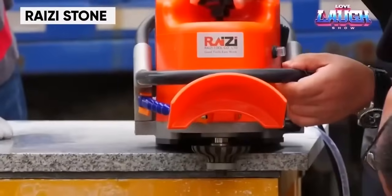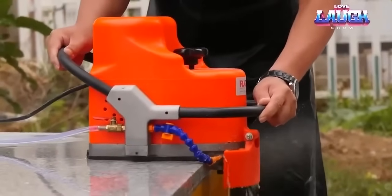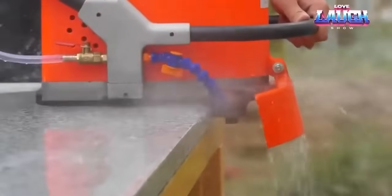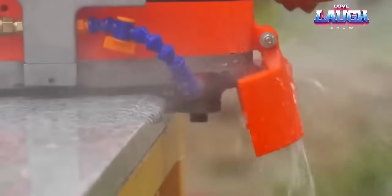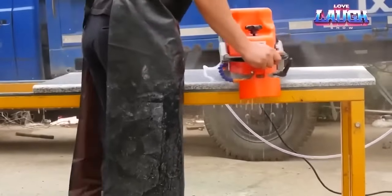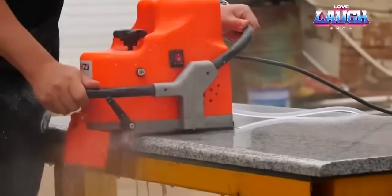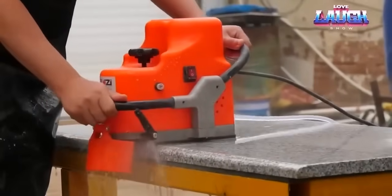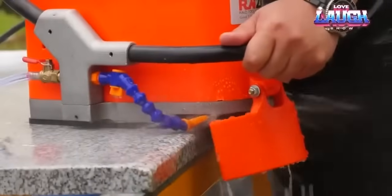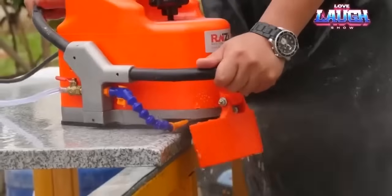The MJ3 is a bit more specific. It is a grinding and polishing machine for stone workpieces, including granite. It is lighter than many analogs, weighing only 26 pounds, but it is equipped with a 3-horsepower motor and allows you to adjust the speed up to 8,500 revolutions per minute, selecting the optimum depending on the task. Since water is used in the process, the MJ3 has received a splash guard, and protection against electric shock is guaranteed by a GFCI circuit breaker. This machine costs $949.